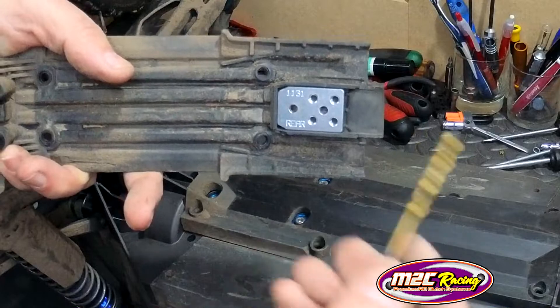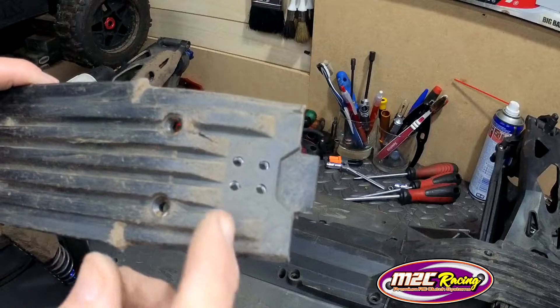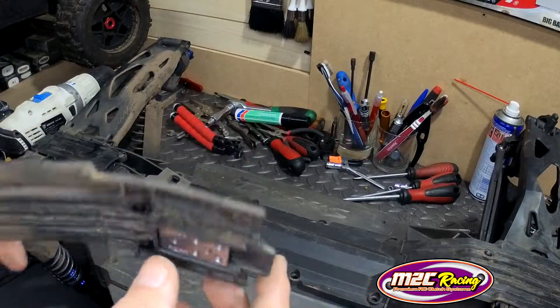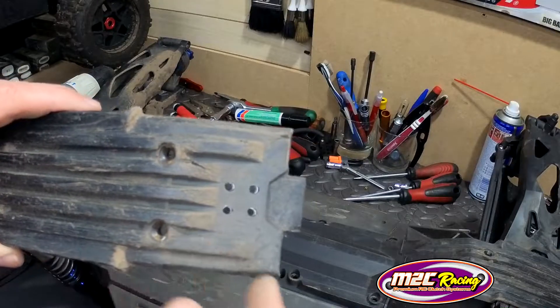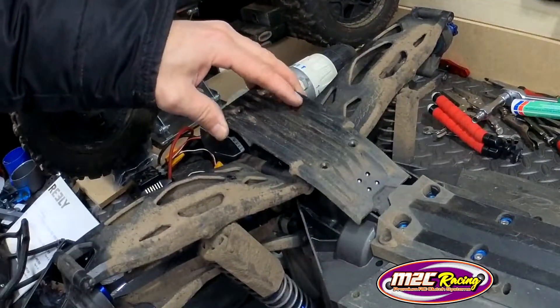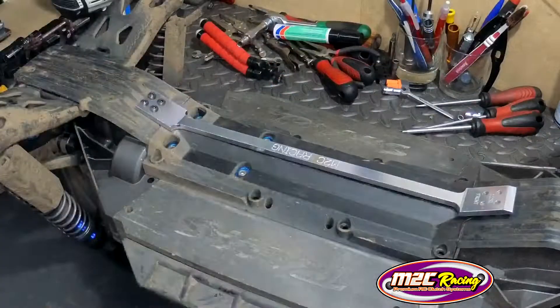When that's done I'll get back. The holes are drilled first with the small drill bit and then with the bigger one. From the other side, you have to pull this out when you do it with the bigger one, otherwise the thread will be damaged. This goes on there and then the brace goes on, so you know where to drill the other holes.